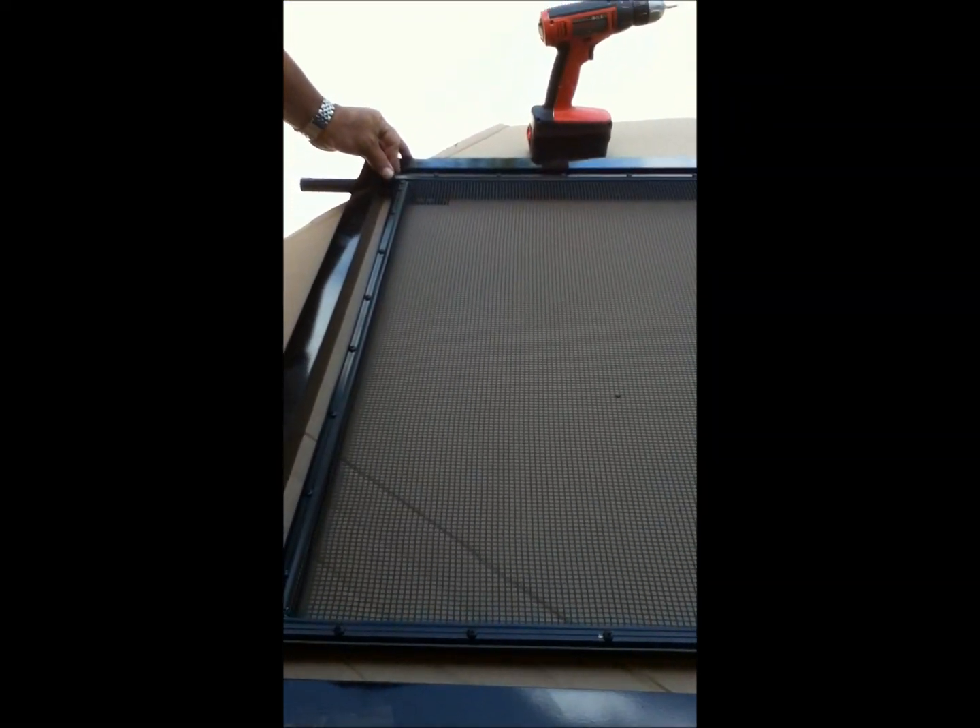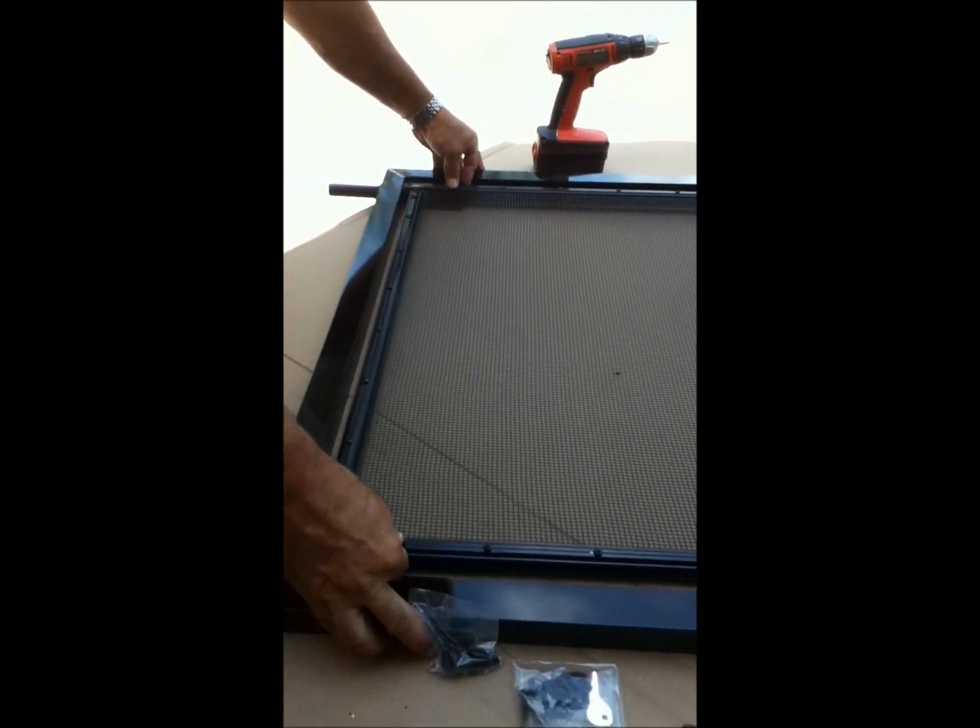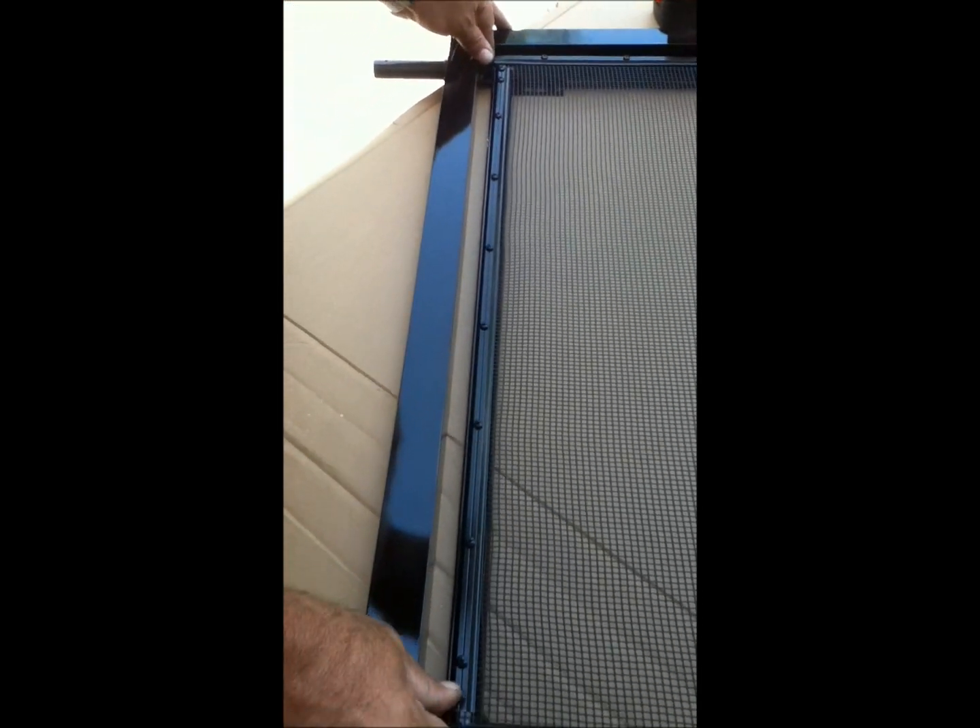What's important here is you don't want to put the door all the way down touching the bottom. You want to have it about a quarter of an inch to three-eighths of an inch up from the bottom bar. You don't want this door rubbing against the bottom part.